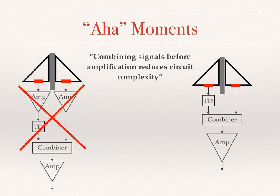Positioning the single amplifier after the combiner eliminates the pesky task of phase and amplitude matching each amplifier. A further benefit comes because the lower frequency signals cancel more than the higher frequencies in the combiner. This provides an inherent high-pass characteristic, lessening the dynamic requirements of the amplifier. And if filtering is necessary, only a single filter is required, and it is positioned between the combiner and the amplifier. So I chose to have no active components before the combiner, favoring sharing and simplicity.